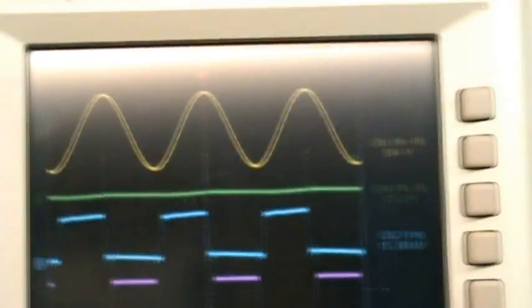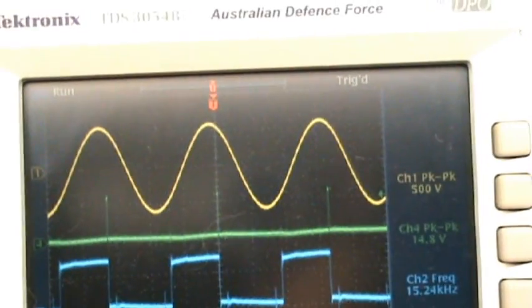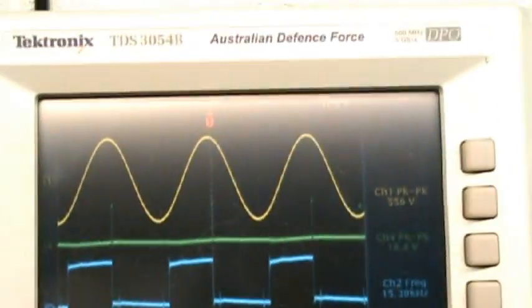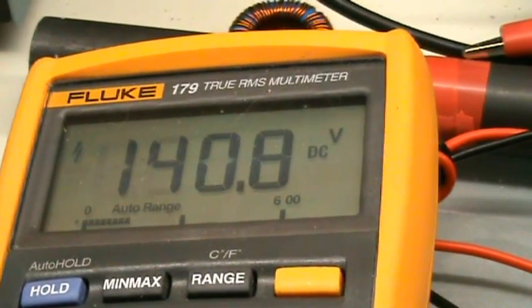And one thing I notice is that when I peak the sine wave on the inductor to be maximum, I do not have maximum voltage on the bulb. There is a difference between the resonance or peak. I will peak it now on maximum voltage on the bulb.